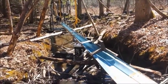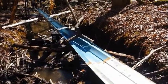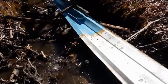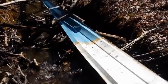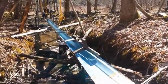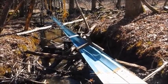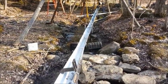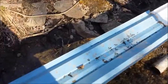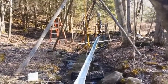There we have a start. I've got two hangers and some bracketry — the clips. I just wanted you to note how I'm bending this up because it's pretty thick gauge steel. I've got that piece of angle iron with some bolts; I slide it along and it folds it up, and then the one in the back helps taper it closed while I put another piece of EMT on the top. This goes fairly slow because I don't have gloves and I'm taking my time. There's a little progress — 30, 35 feet or so. There's my bending apparatus; I slide it and it forms right up. I've got three tripods with the yellow cable hanging it.